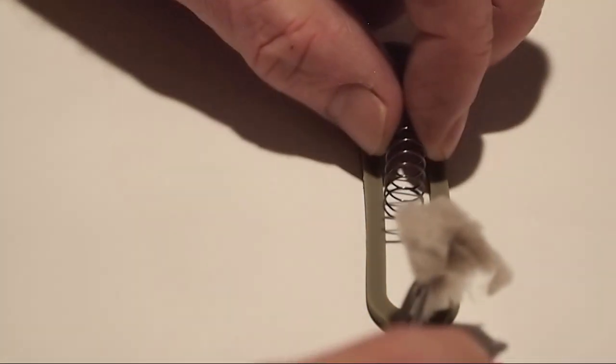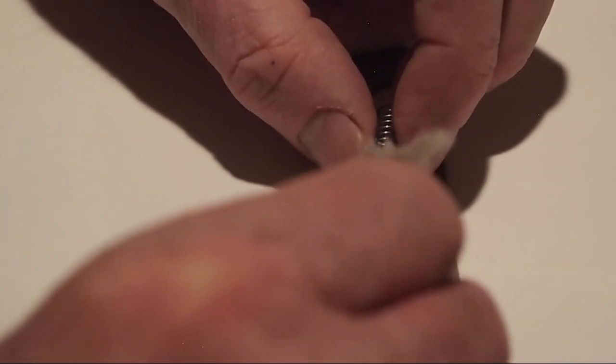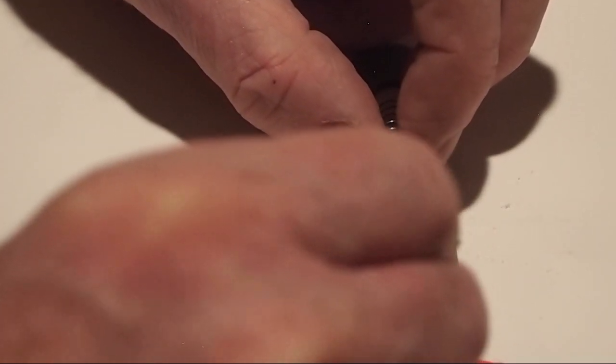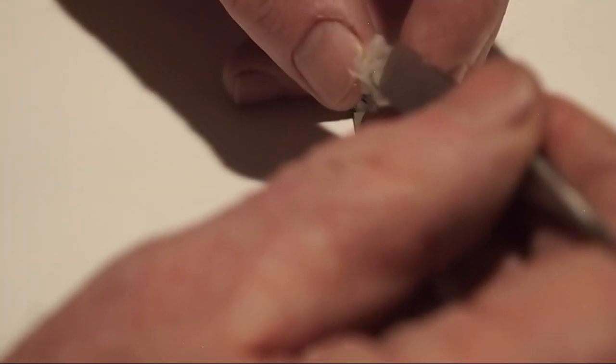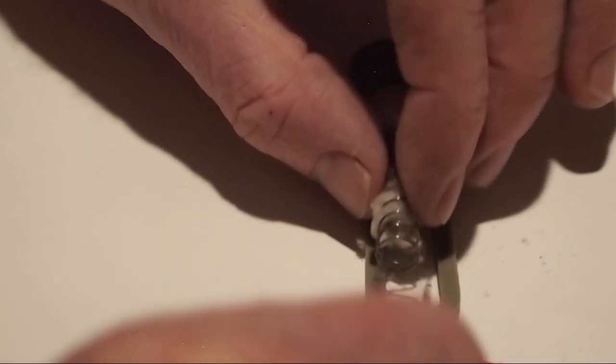So what I have is some platinum catalyst pieces here, and I have my spring, which tends to roll around. So what I'm going to do is take some catalyst material and pack it into the spring with tweezers to the best of my ability. And you can see how when you've got fragmented catalyst, the spring is kind of helpful in that regard. The forceps might in fact be better, and they do recommend washing your hands and not breathing in the platinum catalyst material, the dust from it. So after you're done packing, if you use your bare hands, go wash your hands afterwards.